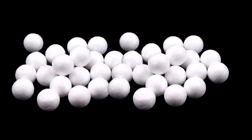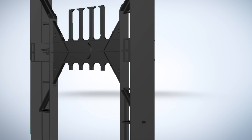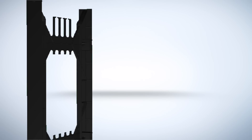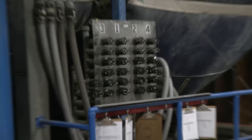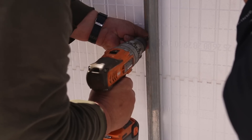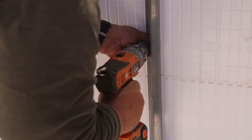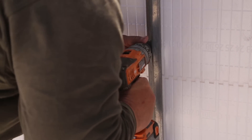Expanded polystyrene foams are produced using blowing agents that form bubbles and expand the foam. Build block plastic webs are made from high-density plastic. Build block combines both new material and recycled material into the finished product, and any scrap is recycled yet again for future use. The build block webs have a screw pull-out strength of more than 200 pounds through the entire web and 500 pounds in the high-density attachment points.